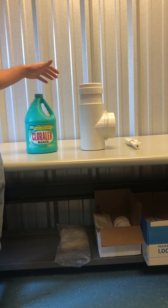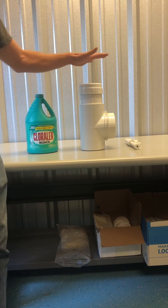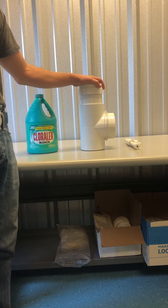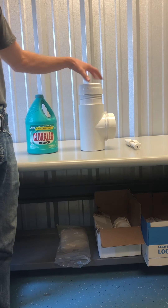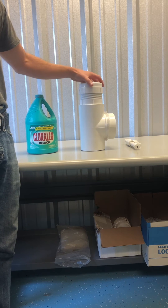The rule of thumb is about one gallon per two people per month. These chlorinators with the extended pipe, either vertically or horizontally, typically hold three to four gallons of bleach, so this should serve a two-person household for three to four months. But like I said, we're going to check them every month just to make sure it's using the adequate amount.